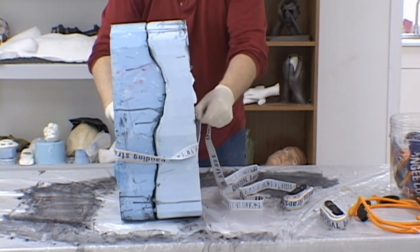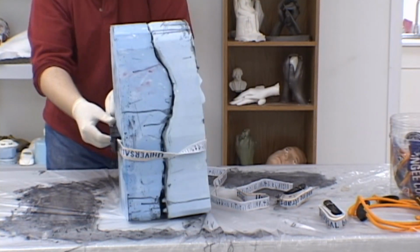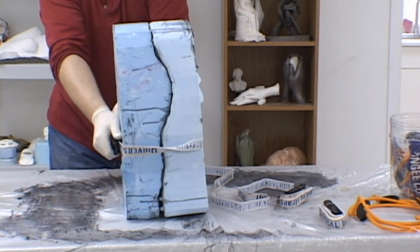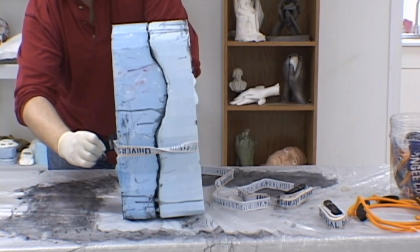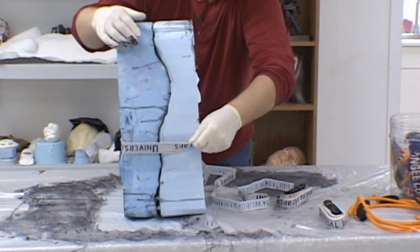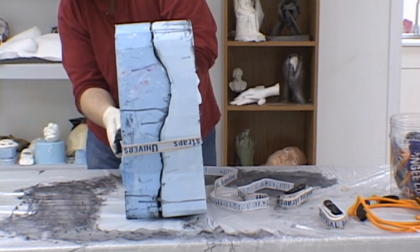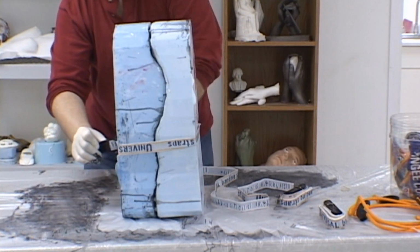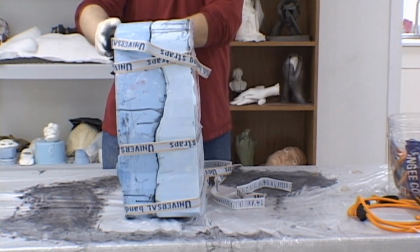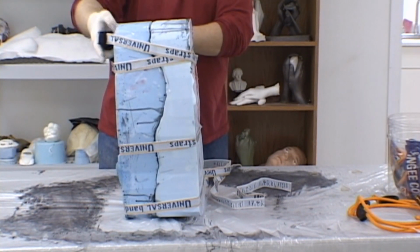After the mold halves have been sprayed with a barrier coat, they are joined together and then held together using band clamps. This is a good way to prepare your mold for casting and ensure a tight seal between the two halves. Use enough band clamps to make sure that the mold is sealed equally and evenly all along its entire edge.